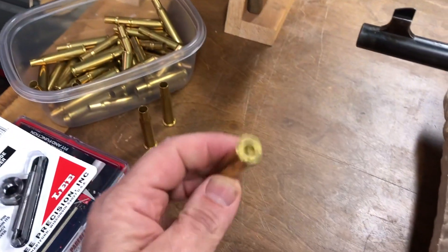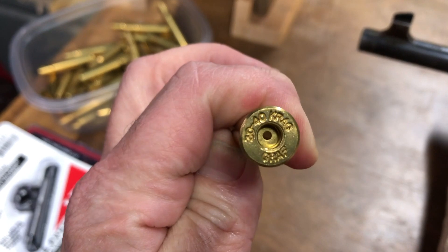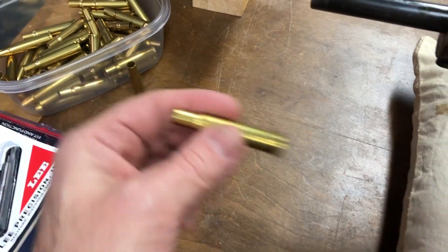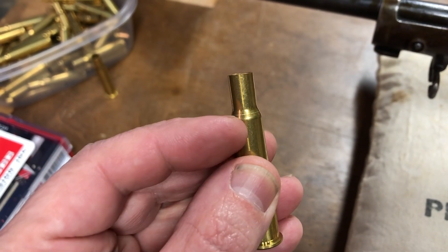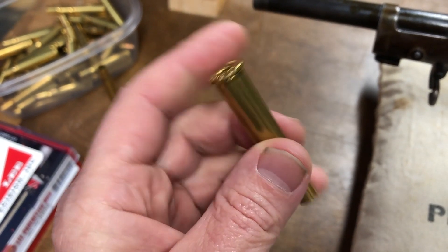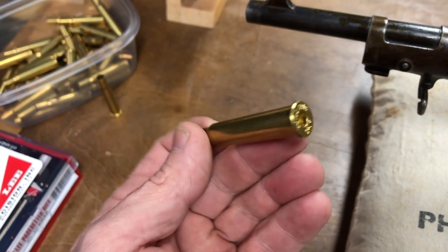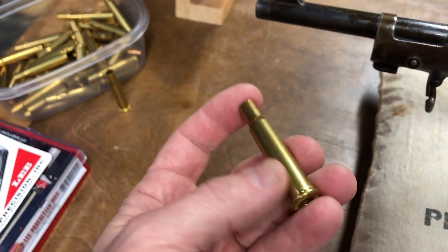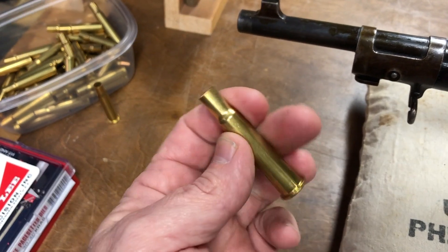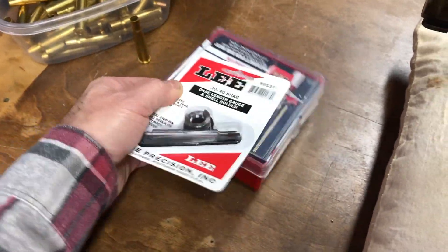I did come up with some brass at a local shop - it's a Graff's headstamp. I don't know who makes the brass for Graff's, but the primer pockets look really nice and the flash holes are really clean with no burrs. I trial-chambered a couple of pieces and they are tight. You can see a little bit of a ring on the shoulder where it is headspacing off the shoulder. I did not close the bolt all the way because I haven't cleaned out the chamber. Once I clean it out, I'll chamber one and see if the bolt will close. If it's too tight, I'll just push the shoulder back a little bit. I'd prefer to have it headspacing off both the shoulder and the rim simultaneously to limit brass stretch. I picked up a set of Lee dies for 30-40 Krag and the trimmer trim gauge.